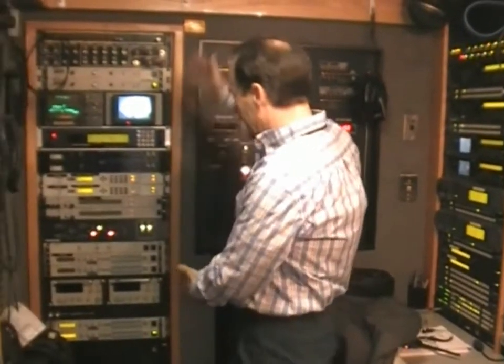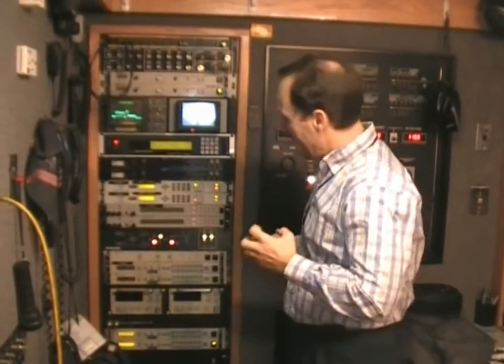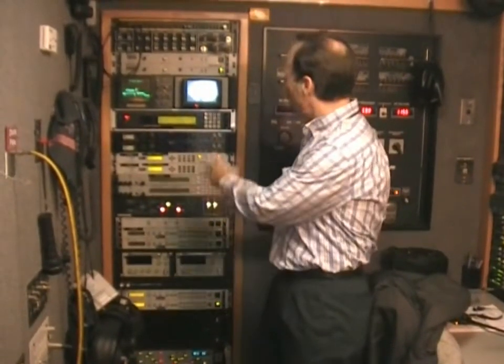Over here is the bank of transmitters. This takes the satellite signal and beefs it up and sends it out to the satellite dish. It actually puts the waves into a waveguide, so it leaves the wires in here, goes up a tube to the dish on the roof, and straight to a satellite — either the KU band or the C band — and it can be a target the size of a quarter that this satellite dish has to hit in orbit.